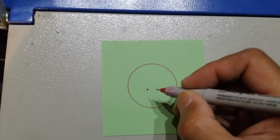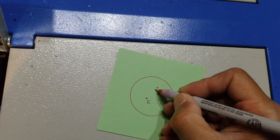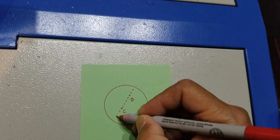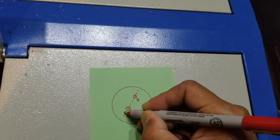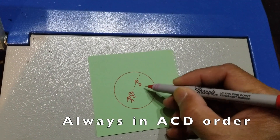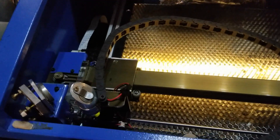This is always going to be the case. So when you're doing your own aligning, you take your close test shot and your distant test shot. Your A is going to be on the line defined by C and D, but it's not going to be in between C and D where most people think it is. Instead, your A is always going to be on the far side of C, usually closer to C than the distance between C and D. In other words, they're always going to be in A, C, D order — they might be rotated, but it's always A, then C, then D.